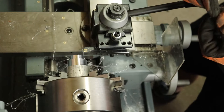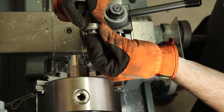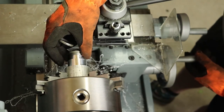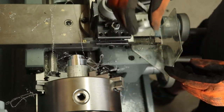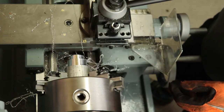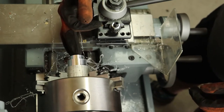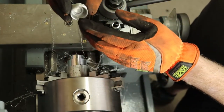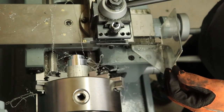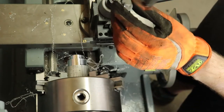I'm going to get the single point threading tool loaded up and try to get a few passes in to see how far I can get with those threads. To check the thread — I'm pretty sure this is 16 TPI. I go ahead and take my thread gauge, stick it down, and they fit perfectly, so I know it's 16 threads per inch. I'll set my machine up for 16 threads per inch, get it in threading mode, and come in with a threading tool. My buddy John popped by and I just finished doing the single point threading — the threads on this now match the threads on the original perfectly. Sits in there fantastic, so the thread is good. Once we get it threaded, we should be good to look at boring this part out, or I might leave it solid since I don't think the hole is really necessary. Then we can take it down the other side to 17mm with a parting tool, lop that off, and put two flats on it so we can get a wrench on it.